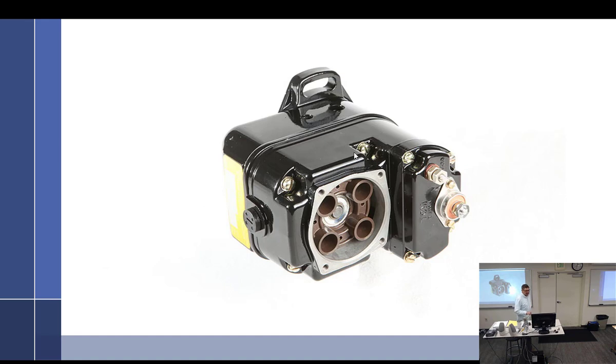Every single engine used to have two. Times are changing. So Lycoming is a little different in some of their engines, like the IO360 A1B6D. If it ends in D in that last designation, then it is a dual magneto, which means it's one magneto that runs both sides. So dual magneto is one magneto, but all the other engines have two magnetos, which means they have one on each side. So you got that? Dual magneto is one magneto, but the other engines that have two magnetos run dual mags. Okay.